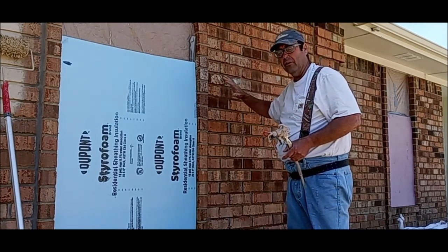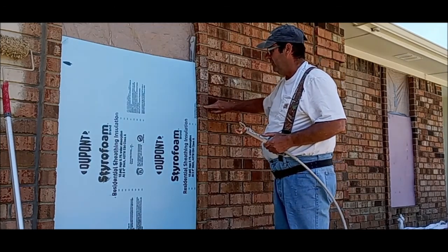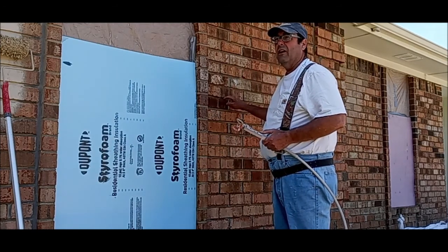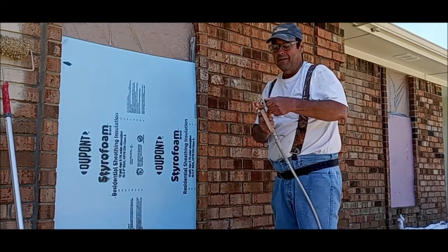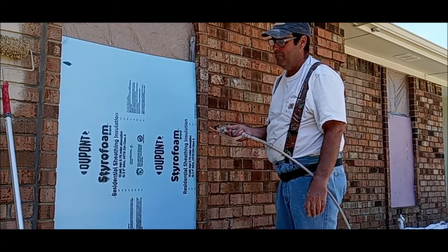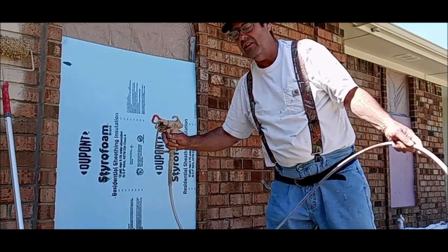It just won't penetrate full strength, so I'm doing a somewhat thinner coat for my primer coat to soak in. Then I'll do a thicker second coat. This stuff comes very thick — if this were a flat surface it'd be no problem. But up in here I've got some really deep mortar joints, so I had to thin it. Sherwin-Williams and the product say do not reduce — disclaimer: do not reduce.